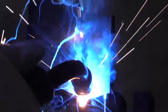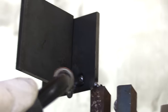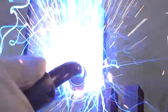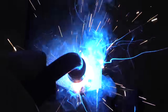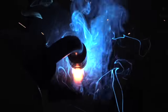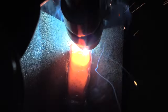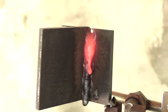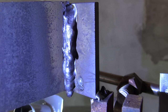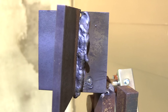Right away a big ball of spatter fell on my boot and I had to stop for a second. I'm going to go ahead and weld this thing all the way out. We all know what's going to happen at those hot settings — no matter what technique you use, side to side, upside-down V, triangles, whipping in and out of the puddle — it's just hot. If this were dual-shield flux core I could just go straight up without any weave and it would be fine, but there's no flux here to help cool the puddle. It's tremendously hot, sagging out and drooping. And there we go — I have created artwork. It looked like it was going to blow a hole through, and then it just dripped out at the end like a big long nose on a totem pole.